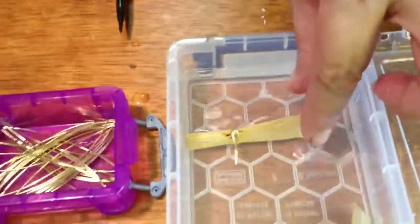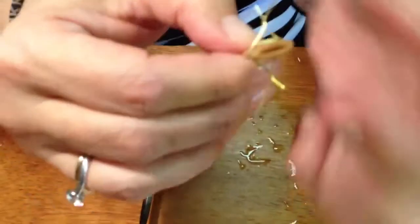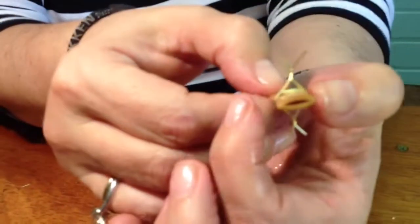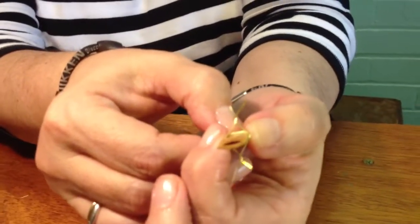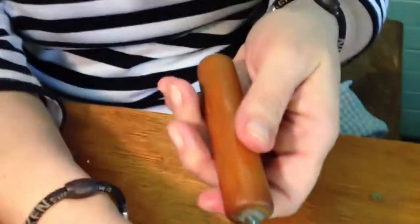The next step in the process is forming, actually forming the tube. We want that opening to become perfectly round in the back. We want it to be about the shape of a football at the second wire and about the shape of an ellipse inside at the first wire. In order to do that, we use a mandrel that has that general shape to it.